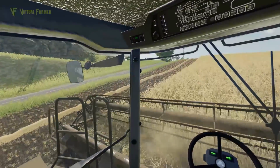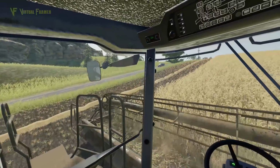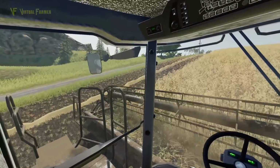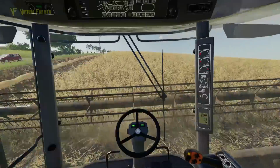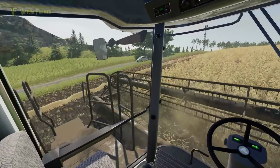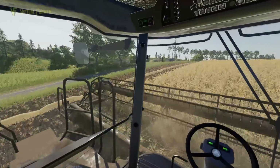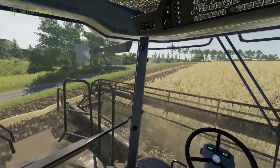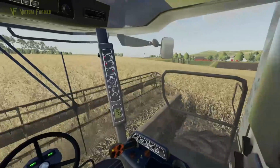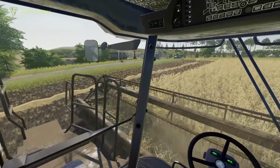The overloader and the gravity trailers are more time saving when you've got multiple people on a harvest, and for me, we're not really doing that. Most of the time, unless it is like this where we're further from the main farm, it's just me doing this, and therefore a gravity trailer might be good, but I can't use it on the field most of the time. The gravity trailers have quite a low clearance, and as a result they tend to pull the straw about, and we want to avoid doing that. It just makes a mess and makes it harder for us to bale up.